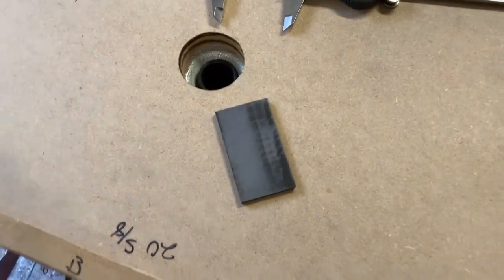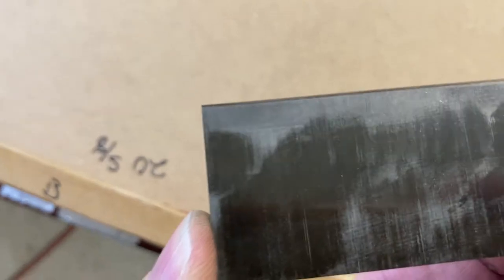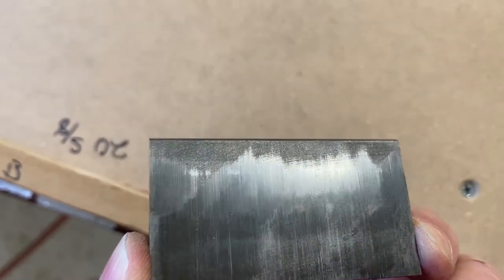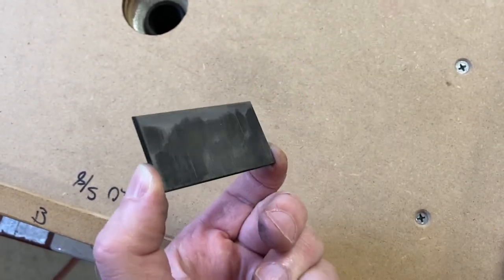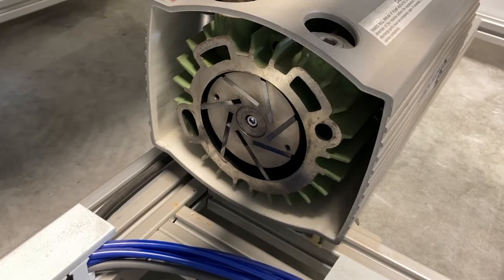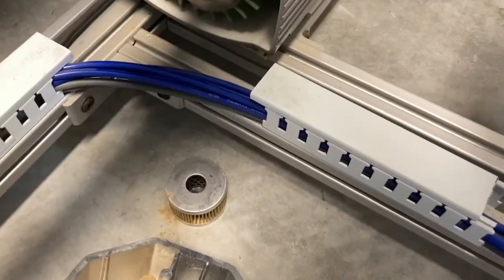35.4 — right where we should be, looking really good. I'm glad we won't have to spend $300 on vanes right now. There's a little wear visible on one side — I'll look at that on the others too — but as they slide in and out under centrifugal force while rotating, all seven vanes measured no less than 35.4 millimeters in height, so we're good to go. We'll put the covers back on and air out the filter.